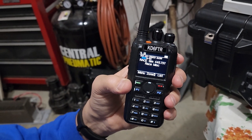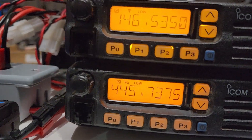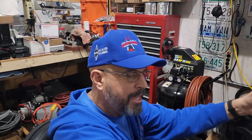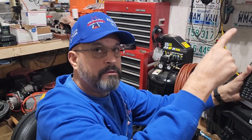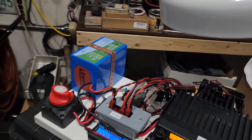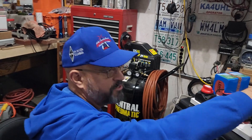Yeah, both sides are set both directions — it's listening for 250.3 and it's sending it. But the most important part is on these radios — on this radio it's not set for tone squelch, it's only set to send a tone. So when I transmit on 445.7375, you'll see the indicator come up that it's receiving and you'll also see it go into transmit. Any RF comes into the radio, it opens the receive with the tone because it's in tone squelch. Anything, including subaudible tones, are being passed out into that pigtail and back into this one, which gets retransmitted.